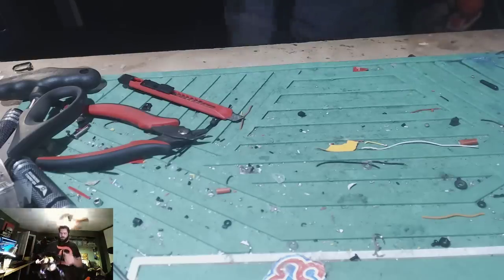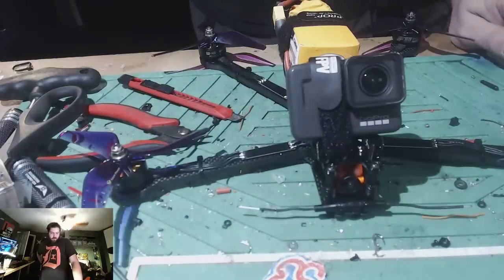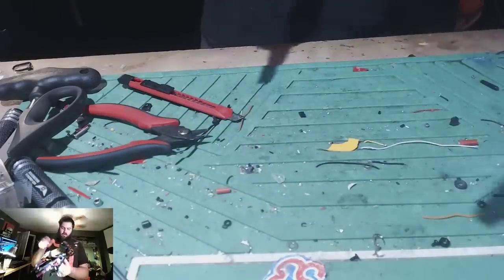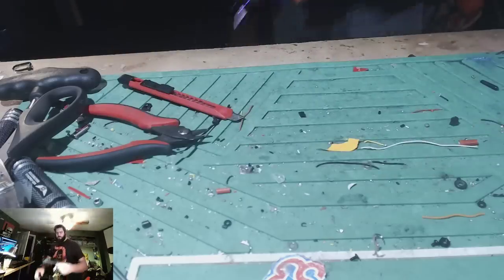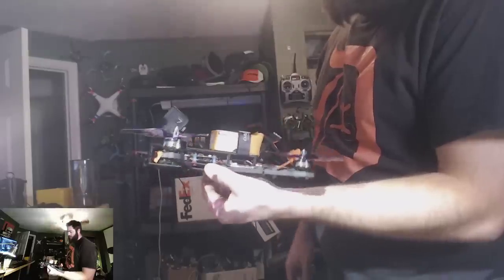Cool. Well, there's a drone. A really, really wide drone. You said CG was bolts for the front arms? No, there's no way. It's got to be bolts for the back arms, because CG for the front arms would be way up here. There's no way that would be the center of gravity. The center of gravity should be back here. It should be halfway between the props, and halfway between the props is not up front. It's in the middle and the back kind of. So I would say that's pretty close, if not back heavy.